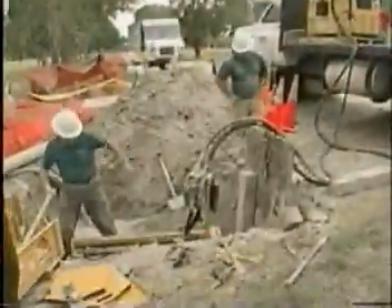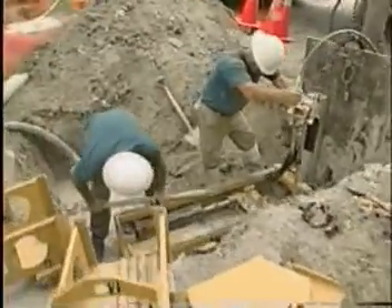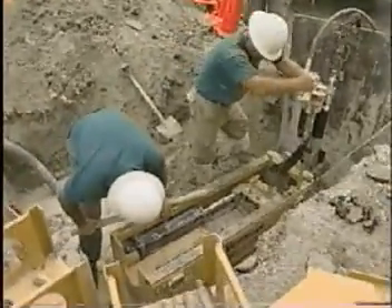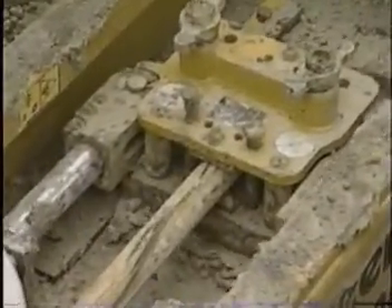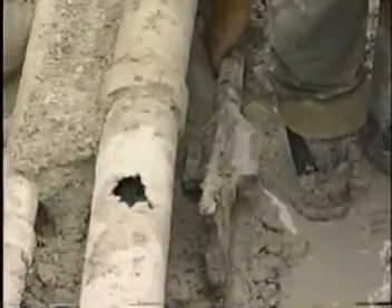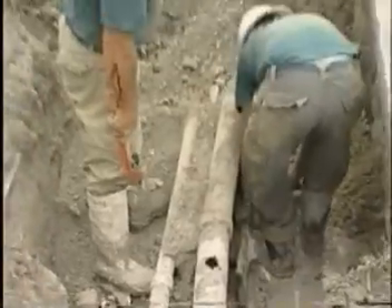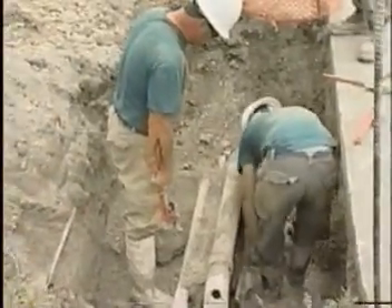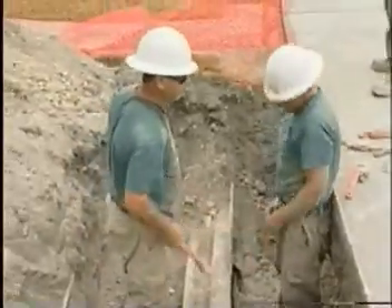What we're going to do now is screw the next rod in so we're all hooked up, then go to pit B at the other end of the job and hook up the expander and the splitting head to the HDPE so that we're ready to go. What we've got on the end in pit B is our rods are through. We are now attaching the splitting head to the rods. Once we have the splitting head screwed onto the rods, we'll pull that back into the pipe slightly, then we'll attach the expander and our pipe to the expander.